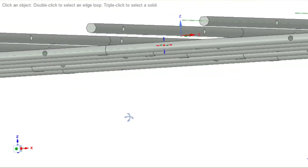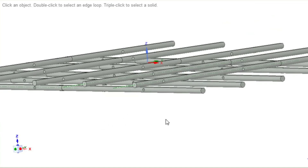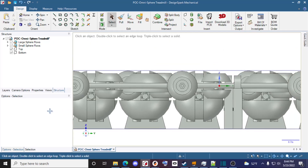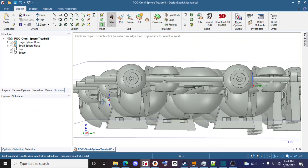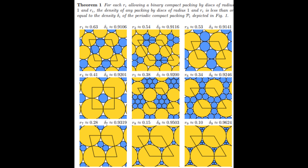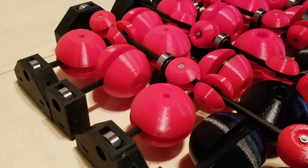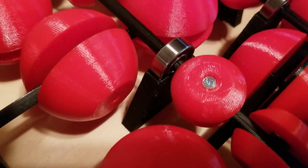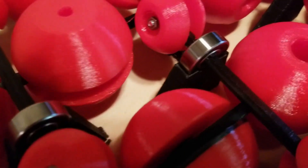The spheres are two different sizes, so the X and Y rods do not intersect, but the tops of the spheres are all along the same plane to, in theory, provide a smooth surface to walk on. For the arrangement of the spheres, I was told about ball packing arrangements on my Discord to minimize unused space, and I chose the R1 configuration shown here. Since the rods would be very long, I need supports at certain intervals to keep the rods from warping under the user's weight.